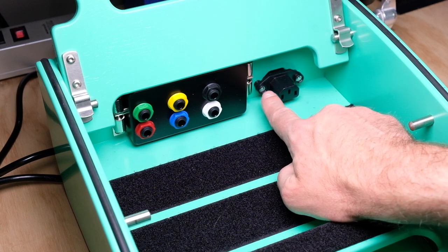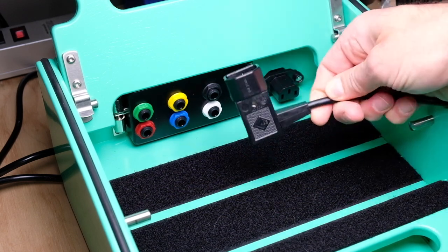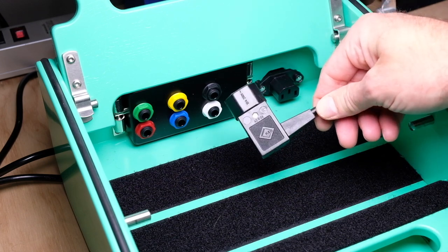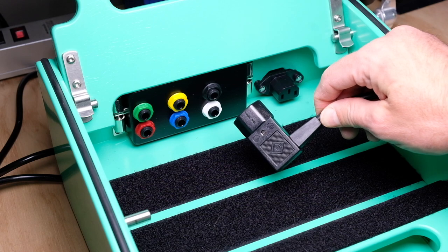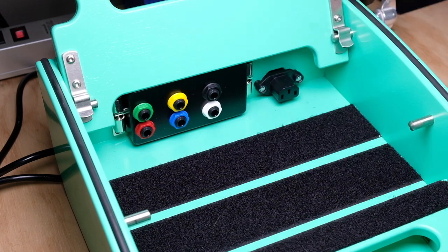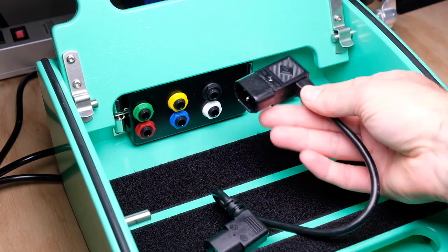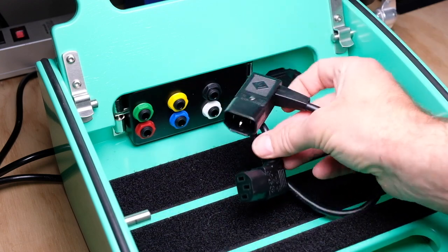As far as the power connection goes, it's a standard male IEC on the back and female IEC on this side. You don't get a power cable with it — you actually just get this adapter. What you would normally do is buy a standard IEC cable, cut one end off, and wire it into that. It's very easy to do, you don't have to solder or anything. All you need is a blade screwdriver and it takes about five minutes. If you don't feel comfortable doing electrical work, you can buy cables that have the standard IEC plug on one side to this end — a male to female IEC plug — for just a few bucks on Amazon.